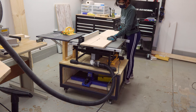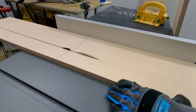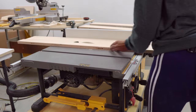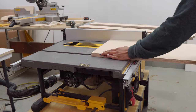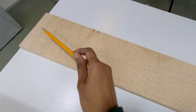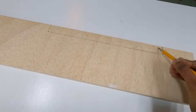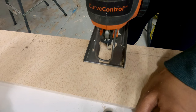Basically I had three requirements for this headboard design: it should have a slant angle so that it will be comfortable to lean on while sitting; it should be upholstered with fabric; and I don't want to drill any holes on the shiplap accent wall, so I prefer the headboard to be connected to the bed frame rather than wall mounted. Based on this I made the vertical framing with a five degree angle on the upper half and a notch at the bottom so that it can sit on the horizontal stretcher I had already installed to the bed frame.